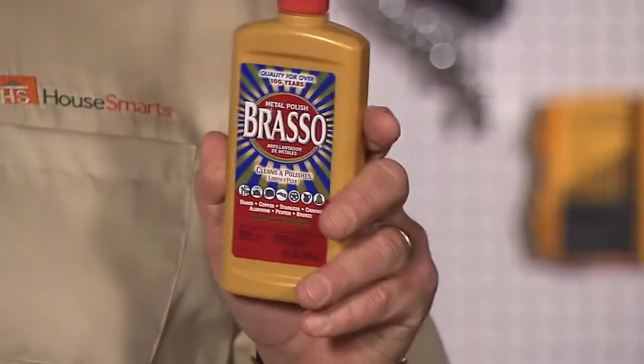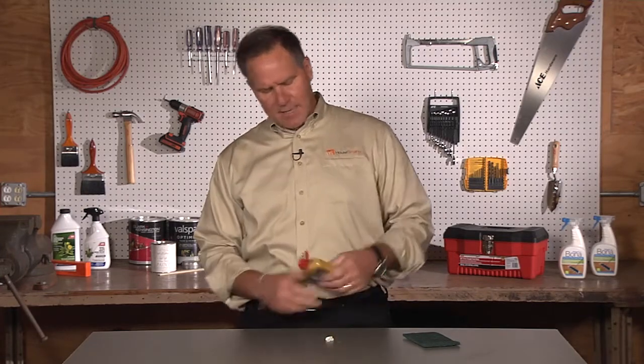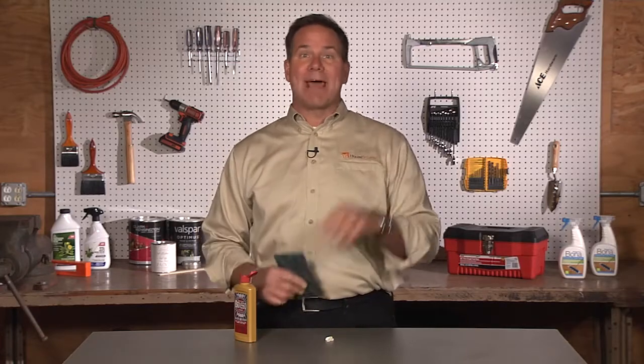Well, Vicki, it sounds like you really don't like that sink at all. Maybe you should just replace the whole thing. But if you want to try and bring it back to life, try a product called Brasso. Funny story — I used this to impress what became my future mother-in-law one Thanksgiving, by polishing some light fixtures that were super dull using Brasso. You can do the same with your sink. It's like a cream that you apply to the sink, and then using a Scotch-Brite pad and some consistent pressure, work in little circular motions all the way around. That patina that you don't like will be removed and you will have a shiny copper sink.